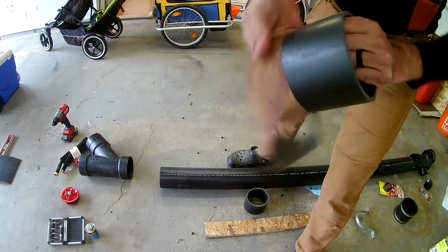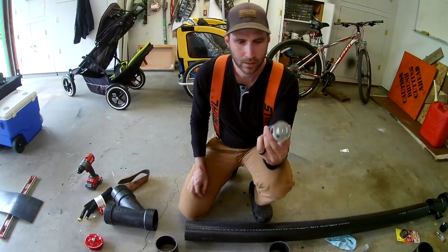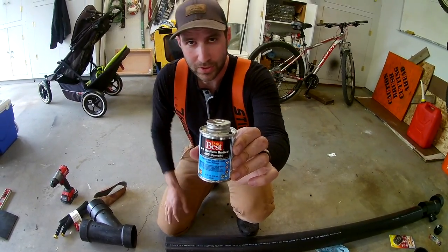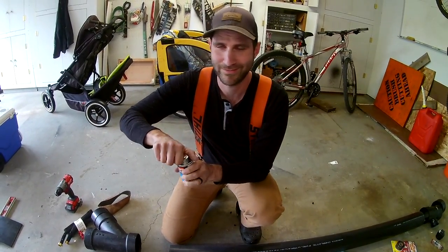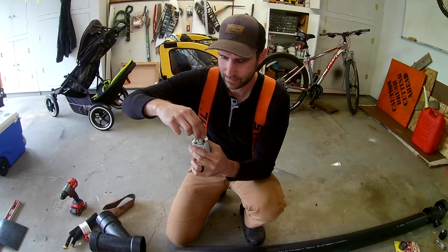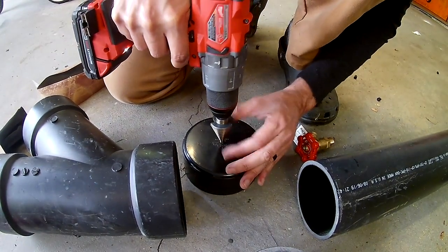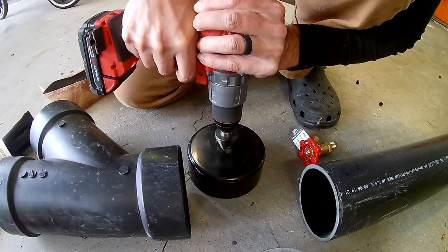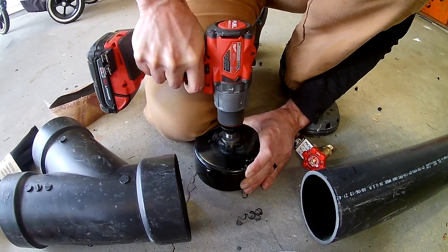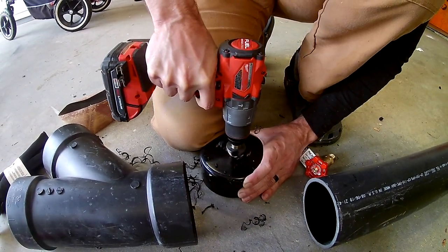You don't want burrs all over the place when you're trying to glue things together. This is the ABS cement I'm using to glue everything together — don't breathe it in deep because it stinks really bad. Then you take your stepper bit — I'll show the bit set I got off Amazon, works really well. Go at it from both sides: drill from the top, flip it over, go from the bottom. That way you get a good even hole since the stepper bit is cone-shaped.